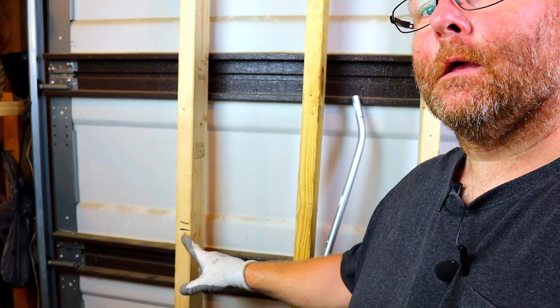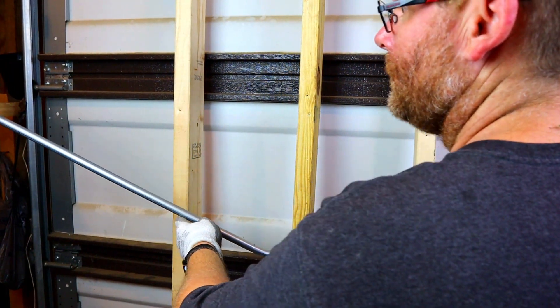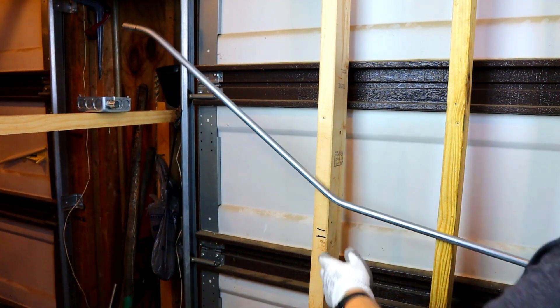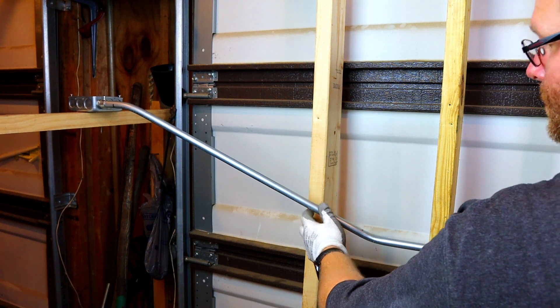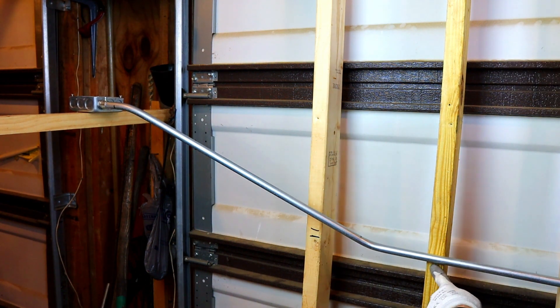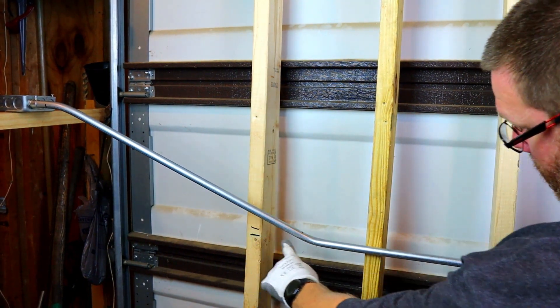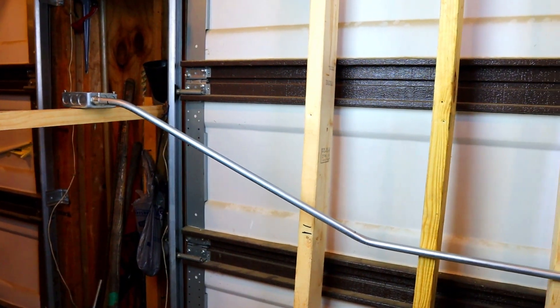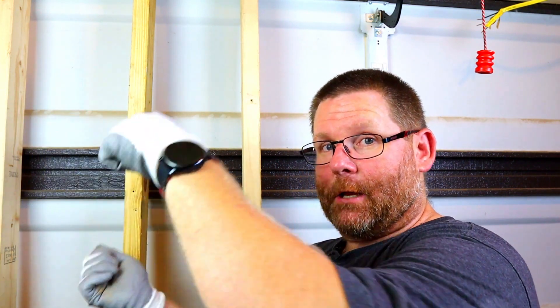There are the marks right there. If the conduit were to keep going like that, you'd get it right into the box. Put it in — boom. Level your pipe up, and if you draw a line through it, it's almost perfectly level where it needs to be. That is all it takes for a rolling offset. Don't let it be something hard, because it's super easy. Measure from the back of your pipe to the back of your connector — problem solved.